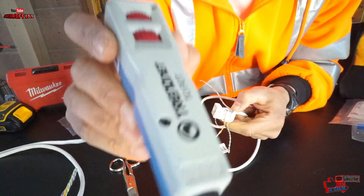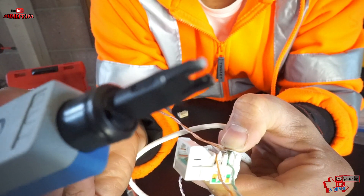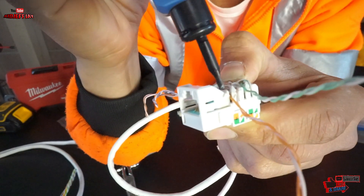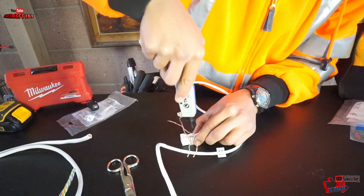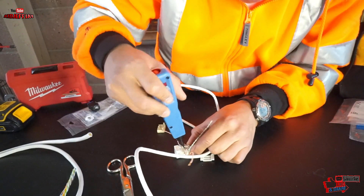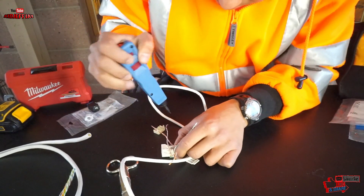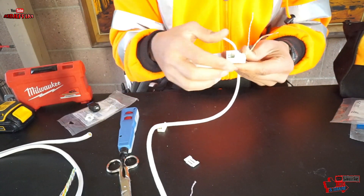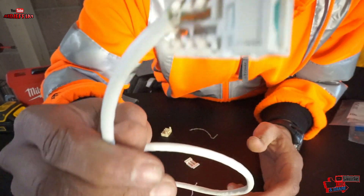You bring out your punch tool. You got to be really careful because it has a small blade — you see the little white shiny thing right there? That's a small tiny blade. You place that little blade from the outside of the jack — you don't want it on the opposite side because you'll cut the wire. You put it on the floor and you hear the punch — it's ready to go. Then you do the opposite side. You pull the blade to the other side. Now you grab the cables, twist them off, and voila — there goes one mount punched in. Color coding perfect. Jack officially done and ready to go.